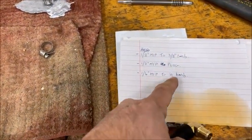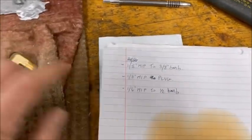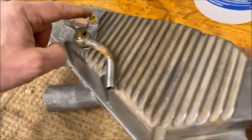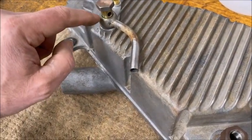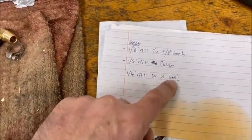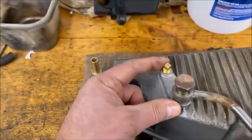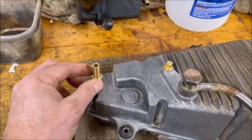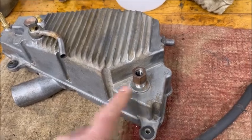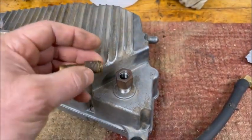That fitting is a 1/4 MIP to 1/2 inch barb — may want to go a little smaller, it's definitely not 3/8, so somewhere in the middle. To summarize: the 1/8 MIP to 3/8 barb goes for the upper fitting, the 1/8 MIP plug closes off one port, I reuse the banjo fitting on the other port, and the 1/4 MIP to 1/2 inch barb screws in for the lower port. I'll screw them in wrench-tight but not crazy tight, otherwise you'll crack everything. The only real pressure connection is the one that previously had the banjo — no pipe dope needed since it wasn't leaking before.